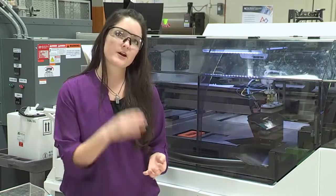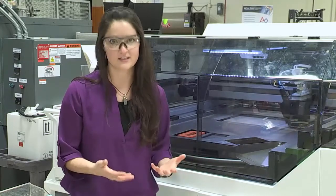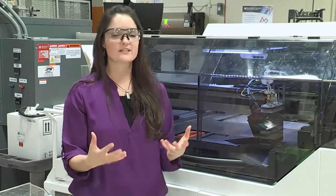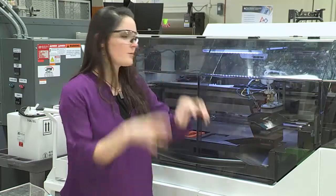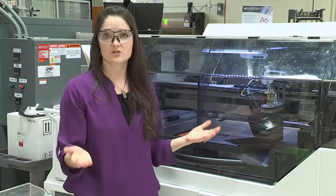We did a test print — we printed on the electron beam and the binder jet just to do a race to see which one would be faster. The electron beam actually produced the geometry fastest at about 25 hours. Then the binder jet produced the same geometry in about 32 hours, but that's all three steps of the process. What we found is that if you doubled that order, the binder jet would still take about 32 hours — because the more parts you put into that build pack, it doesn't really increase the build time. Whereas the electron beam, that time scales more directly. So with binder jet, because it is a batch-wise process, we can actually print lots of parts all at once in a short amount of time.